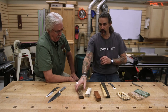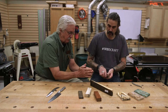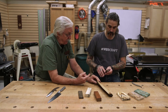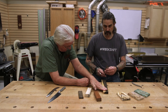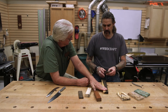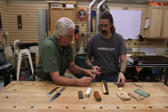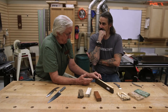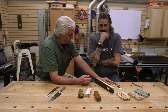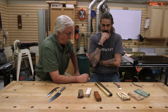What kind of thickness should we shoot for? About three-eighths? If we split this right down the middle we should be plenty. If you want thicker sides, we'll cut it in half and make one side out of each piece, but then they wouldn't be bookmatched. Three-eighths looks like it'd be fine — by the time we trim it up and add a thumb notch, it'll get a little thinner, but these two plus that thickness will still give you a decent hefty knife in your hand.